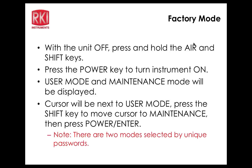All right. Okay, so there's the factory mode. Some of the same things as in the maintenance mode, so we'll touch upon the differences. Go down to gas combinations. Here's where you turn your channels on and off. HC select is CH4 or hydrocarbon. Log time display, again in the display mode setting. CSA for Canadian Standards Association. We can activate those settings here. Alarm points, flow adjustment, you can do that. Some of these values are the same. The A to D values are here. They're not in the maintenance mode. Save default, LCD contrast, factory default, and then start measurement.